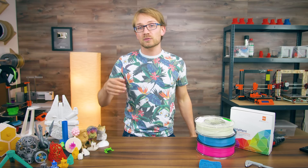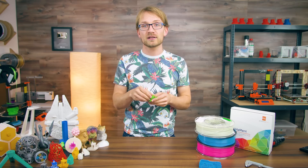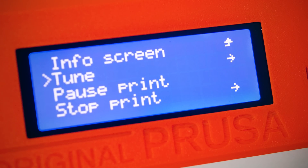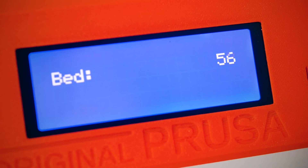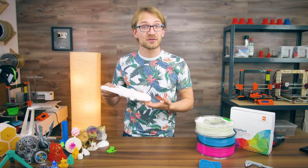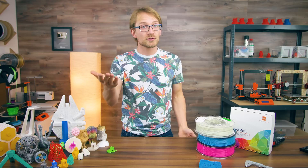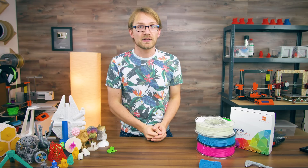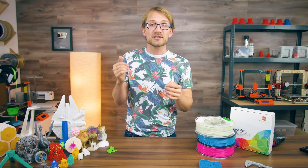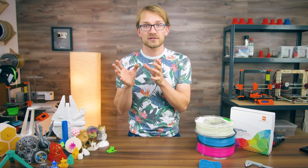The bigger impact will be print and bed temperatures. If you see curling artifacts like these in the first few centimeters of your print, chances are all you need to do is drop the bed temperature by 5 degrees to keep them at bay. You don't want to melt your print with the bed — you just want to keep it at a comfortable temperature to prevent warping. As long as larger prints still stick, there's no reason to use your heated bed at higher temperatures. The default print profiles for your specific machine will usually be pretty good already, unless you went for a manufacturer that doesn't know how to use their own machines — in that case, start with a known good profile for a similar machine and make small corrections from there.